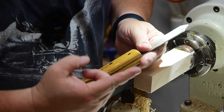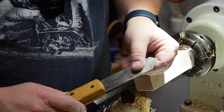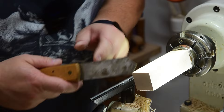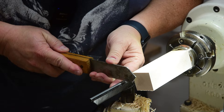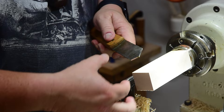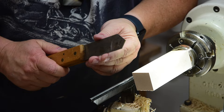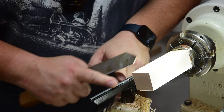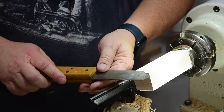Here's why it's crap. Imagine this: you get your brand new lathe, set up all your tools — your parting gouge, spindle gouge, roughing gouge, the skew that scares the hell out of you — and you have to part off your work. So you grab this narrow tool. The advantage is it removes so little material you save wood. But it makes a very narrow kerf, and then things start binding up. Wood moves, it starts pinching, you start burning the side, caramelizing the wood. It requires more force, and that narrow steel piece magnifies the dent you create on your tool rest.